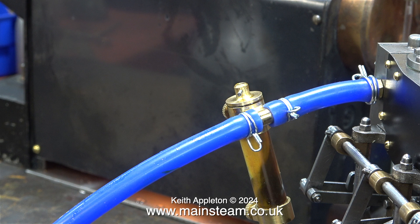Here you can see the principle: the oil floats on top of the water. At the moment it's not floating on top of the water, but it will do when it gets warm, and that is how displacement lubricators work. The oil floats on the water, and the water is constantly being condensed in the lubricator, therefore forcing the oil from the lubricator via a small valve into the steam line.